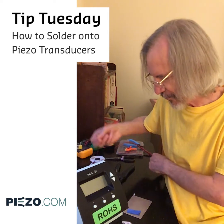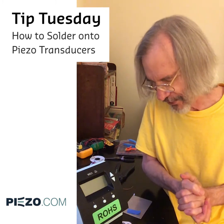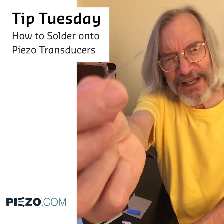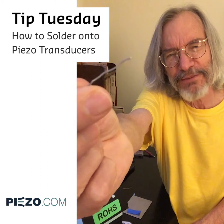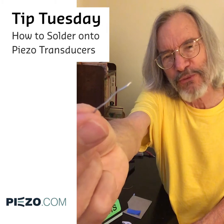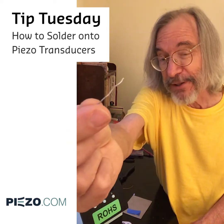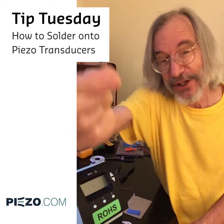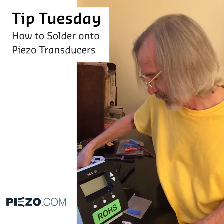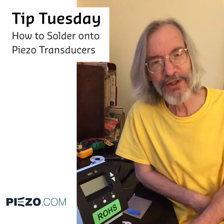I'll remind you that you can get the kit we sell that has the flux and solder. Use tiny solder — don't use big fat stuff. I would also recommend you use RoHS-compliant solder that has no lead. If your prototype ends up working, it's going to go into production and you'll have to use this stuff anyway, so just get it and use it. There's nothing wrong with the joints it makes — it works just as well as the old tin-lead solder.